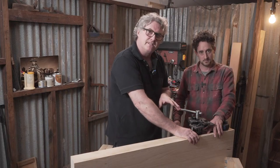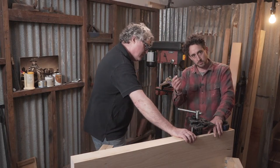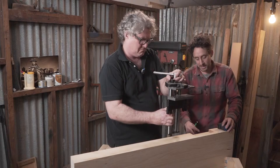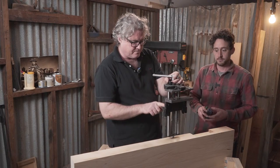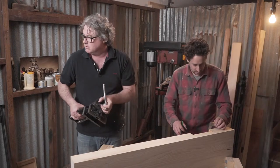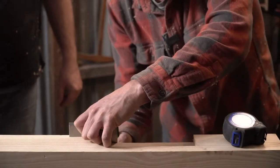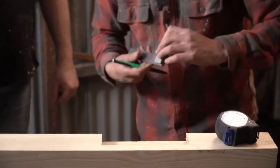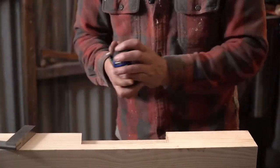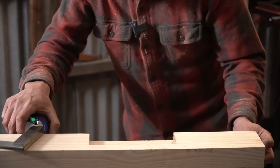We've fitted the vice - had to trim a little bit in the rebate but it's slotted in quite nicely. I used a permanent marker to mark the positions of the holes on the back. I'm actually going to drill the holes for the bolts from the front though, so I need to transfer those positions to the front. It needs to be pretty accurate otherwise your bolt won't go through the hole, so I'm going to use a combination of techniques to get all these holes to line up.